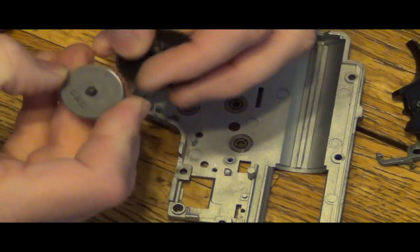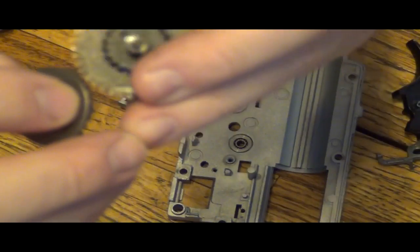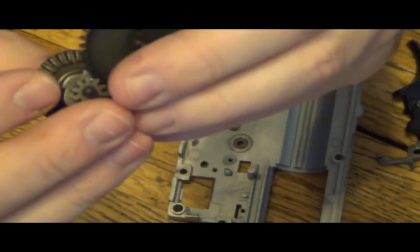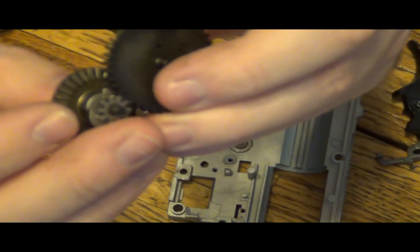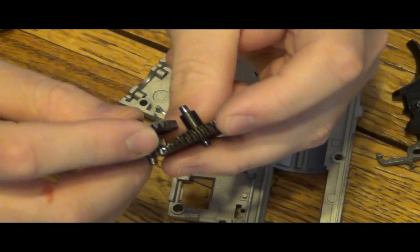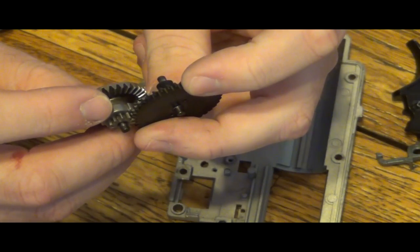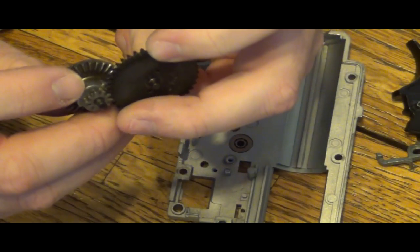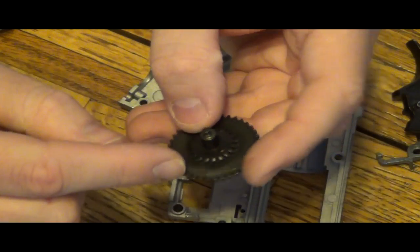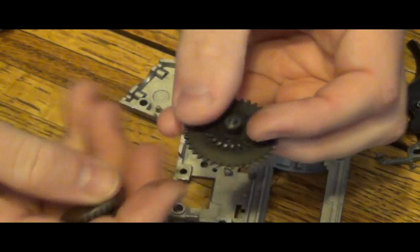I say it as a percentage, so let's show here on the camera. So you turn your gear over sideways. So here we can see the contact. All right, so this right here would be 100%, but it's touching, so as this would turn, it would create marks. So here's example marks right here on the top, and you don't want that.